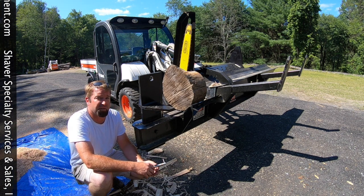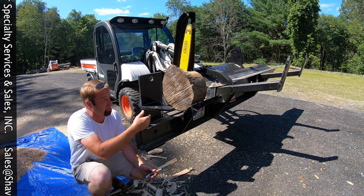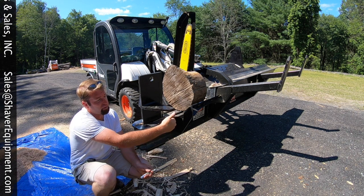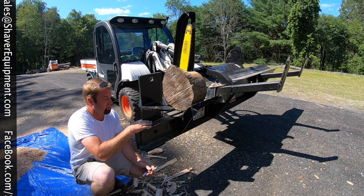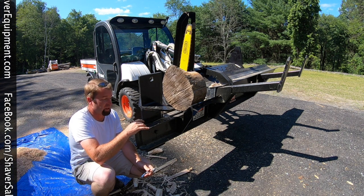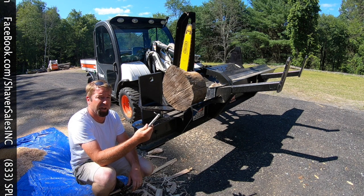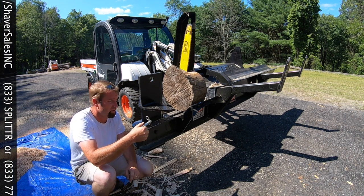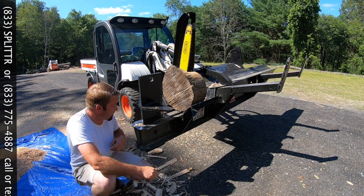And usually that gives me enough freedom that the resistance of that coming through, because of how it splits, there's actually an angle here coming up and an angle coming down. And if the wood gets forced in there just right, it'll create some down pressure between this bottom ear and the I-beam. So the hitch pins are usually like a grade 8, so they're pretty stout. But again, it just gives you that 3/8 of an inch that when this goes in, that'll float just a little bit. So we'll swap this out and I'll show you what I'm talking about.